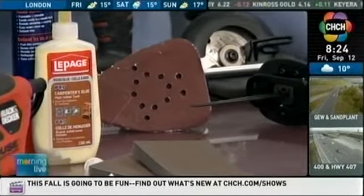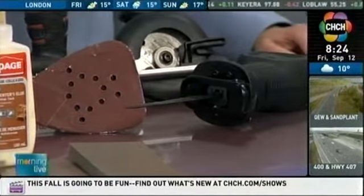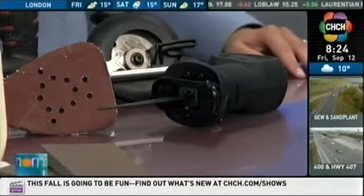Sanding the surface is so important, because not only do you want to get any glossy surface off, you want to prepare the wood, for example with the dresser, to be able to take primer, for it to grip. Right, because that dresser, if you'd just started painting it, it would have all soaked in and no finish at all. Or with more laminate type pieces of furniture, there would be no bond. You'd basically scratch the paint right off. So that's where primer comes into play.